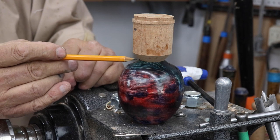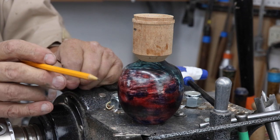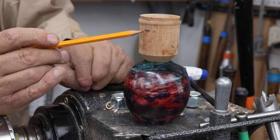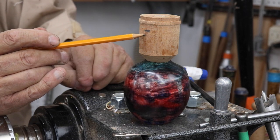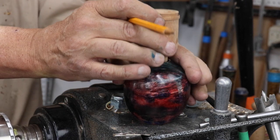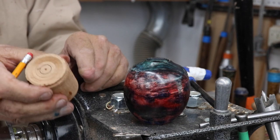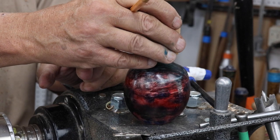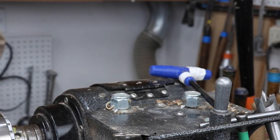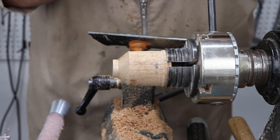My vessel from the opening to the base is right at 3 1/4 inches. So you could figure that out mathematically. I really think that is still too tall. I don't want to cut too much of it off, so I'll put that back in there and probably go down to this point here. Plus, the diameter needs to be reduced quite a bit here. Got a big hunk of wood there, and we'll have to kind of fine-tune that as we go along. So let me put that back in my chuck jaws. All right, now I think everything down here is okay.